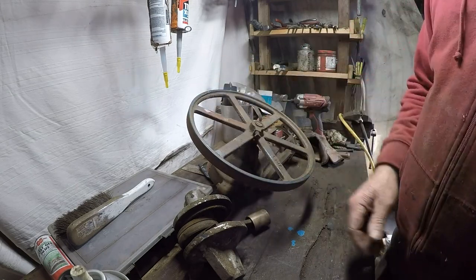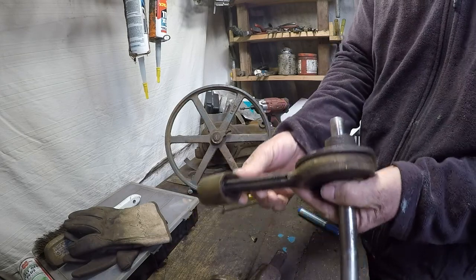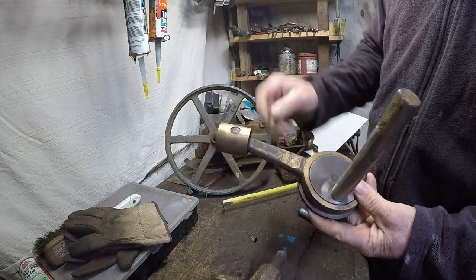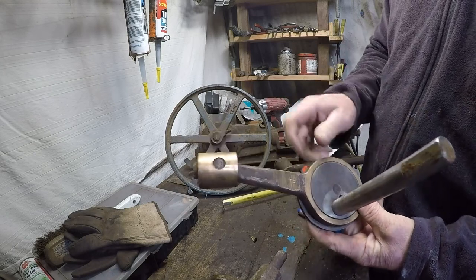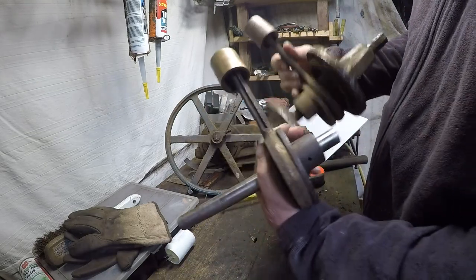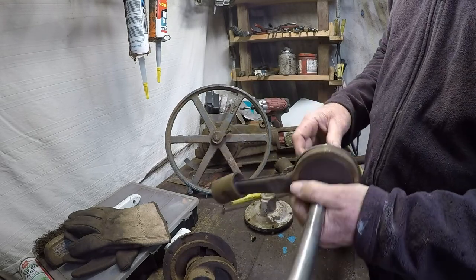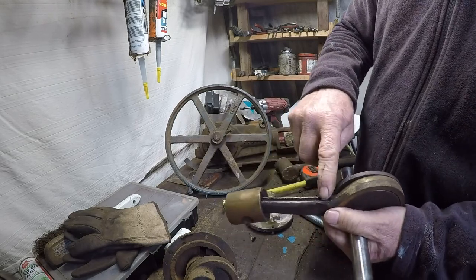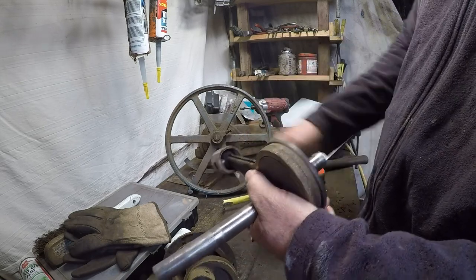If you're wondering about that groove on the top, have a look at this one over here — it's actually a full bronze eccentric strap. They've actually ground this section here; sometimes it was hard to get them into the back unit as these seem to be wider than the others. It looks like they ground it just to fit. But these generally always came with the trench up the top, then the hole — and if you look down that hole you can see straight onto the gudgeon pin.